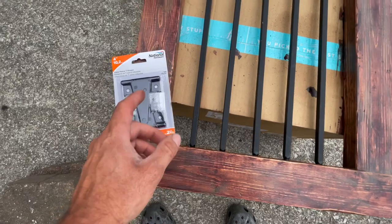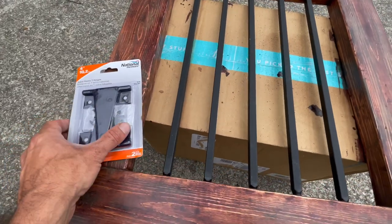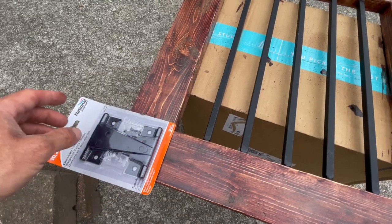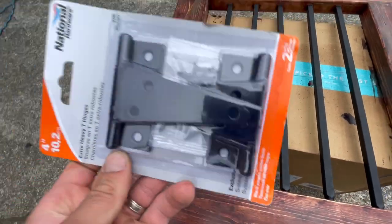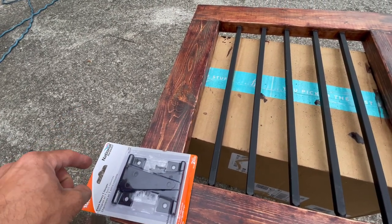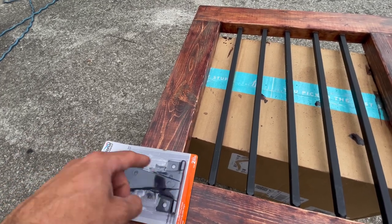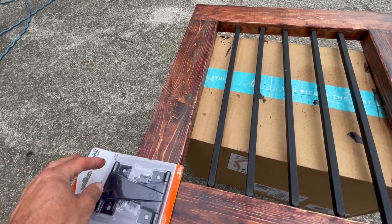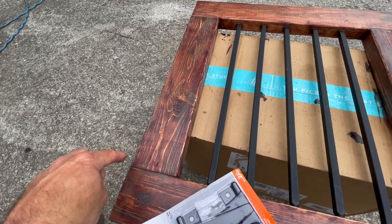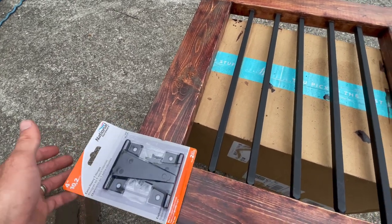And now on to, oh, and I don't want to leave out, depending on the hardware you use, it's probably going to be best to put those on the back regardless, because it might get in the way of your hinges. But I chose this flush, or this outside mount hinge, because I knew I was going to screw into the existing trim that I'm going to be putting up here in a minute, and then this would be on the face in it regardless. So I figured, why not? I mean, I could have got a hinge that you just saw the front here, but this was more rustic and the hinge part itself would actually be hanging out. So I thought, why not just go a little more rustic?